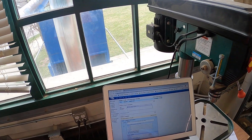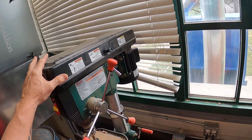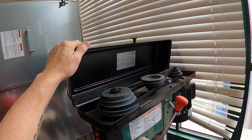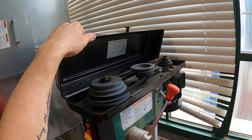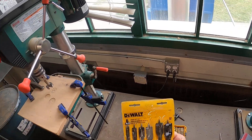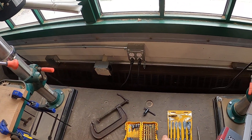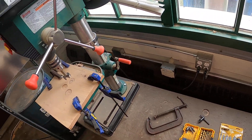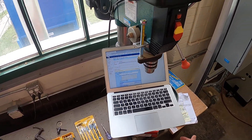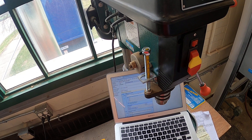Our first question: holes over blank of an inch should be bored at the lowest speed. We can change speeds with our belts on the different settings — there are at least 12 different settings. The answer is one half of an inch. So if we look at the paddle bits, here's a half inch. Anything bigger than that, or a twist bit, we want to go the slowest speed. The Forstner bit here is an inch and a half, so we go on the slowest speed. Anything over one half inch needs to be run on the slowest speed.